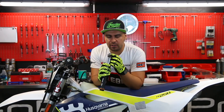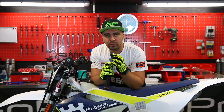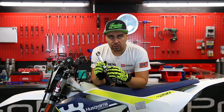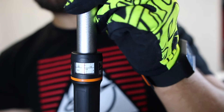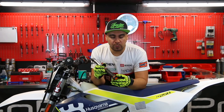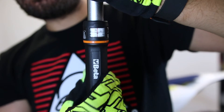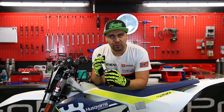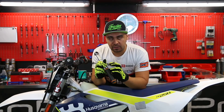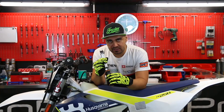Looking at the details of this torque wrench, we find here where we can place 3/8 sockets, which you'll need to buy separately. On the back we have a little switch to change the direction in which the torque wrench works. Going down we see there's a small window with all the Newton meter values ranging from 8 to 60 Newton meters. Going down further we have a little tap that we need in order to adjust the torque wrench — we'll turn it around and in this way we will be able to start twisting it and see the different values changing on the window, placing it to the value I want. Once I place the torque wrench at the Newton meter power I want, I'll twist back the little tap and everything will be fixed and I'll be able to start to work.